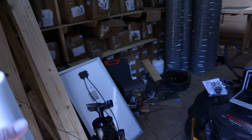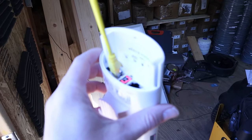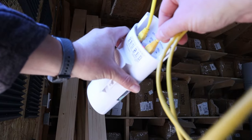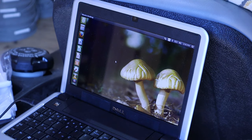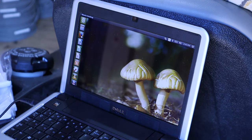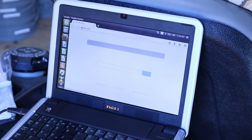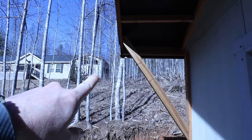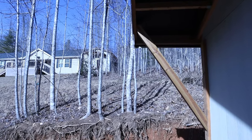The only device I could find to test was this old miniature laptop with an ethernet port. I'll need to get a wireless router for this unit that does 100 megabit. Let's go ahead and plug in a Cat5 cable — one end to this port on the bridge, the other to the laptop. The display shows a connection. Let's open the internet browser and try to load Google. There we go — the internet is connected. The distance is somewhere around 150 to 200 feet between these two buildings, and the signal strength is nice and strong. I think even with trees in the summertime there won't be any issues.